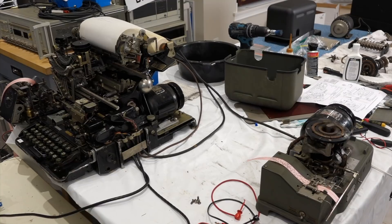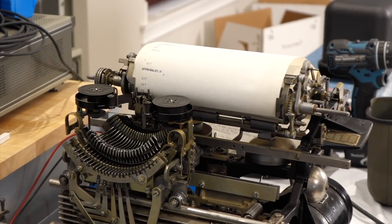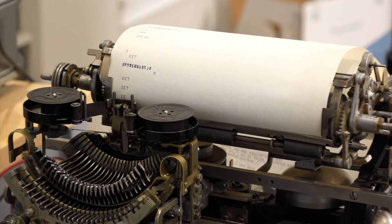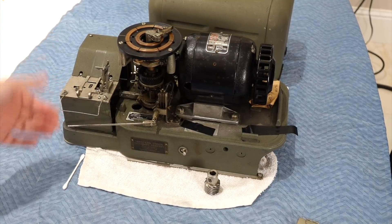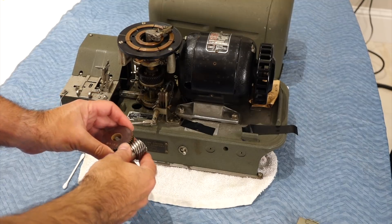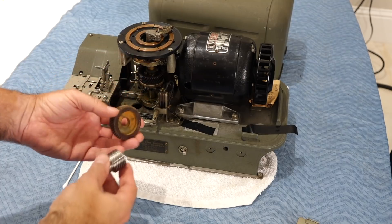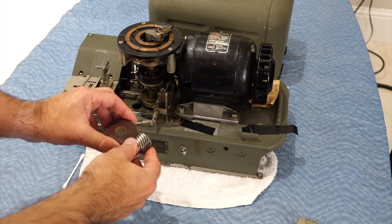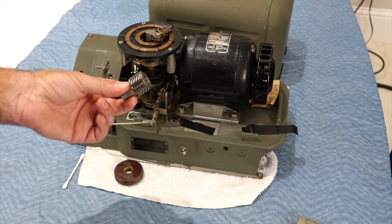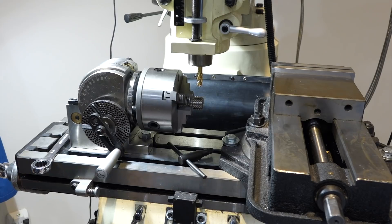But this one over here is not garbage — well, it's transmitting something but it's garbage. The question might be: is it a different speed? It's choosing too fast, and it's choosing too fast because we have the wrong gear in that one. There's a set of two gears, and we found the right one for the mesh gear, but we don't have the right worm gear. And of course Teletype won't send us any from the 1930s.